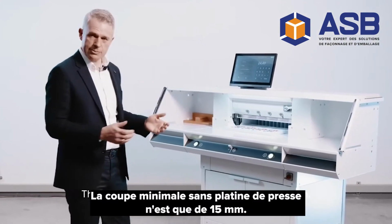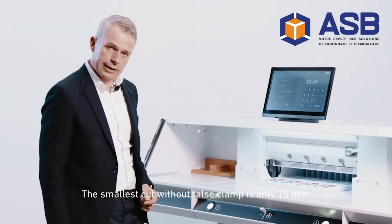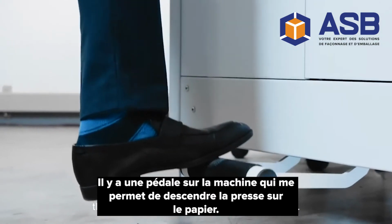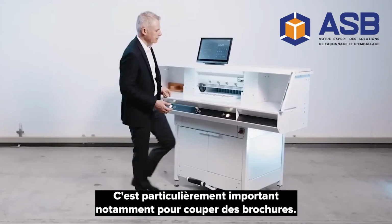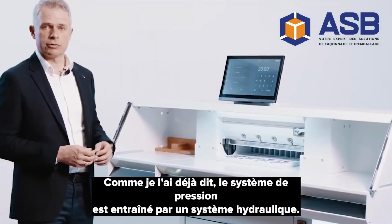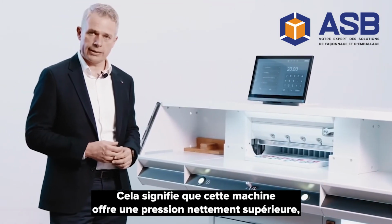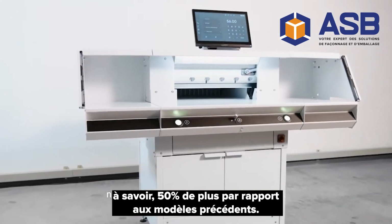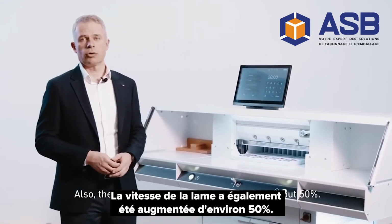The smallest cut without false clamp is only 15 millimeters. There's a foot pedal on the machine that lets me bring the clamp down to the sheet. This is particularly important when cutting things like brochures. As I said before, the pressure is created by a hydraulic system. This means that this machine offers significantly more pressure, namely 50% more than the predecessor. Also, the blade speed has been increased by about 50%.